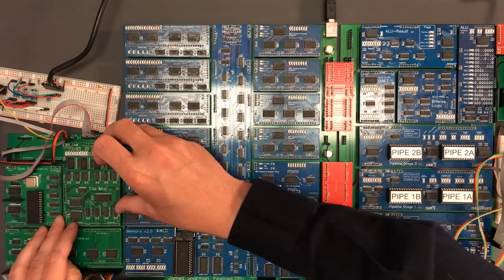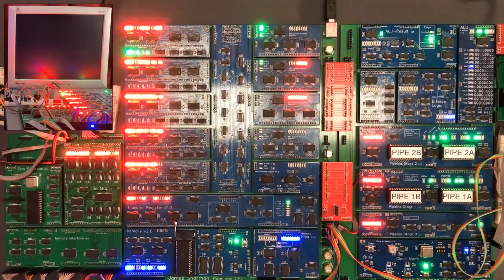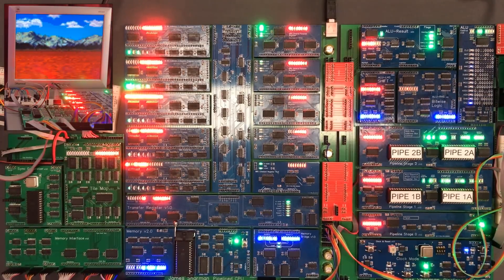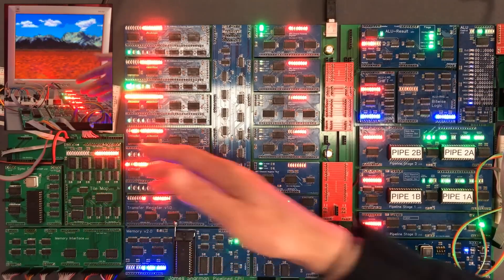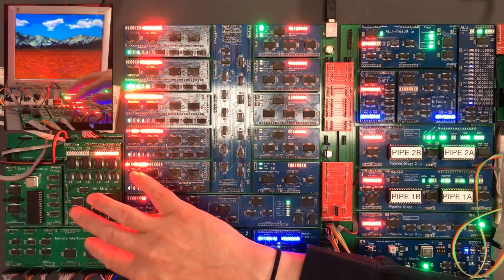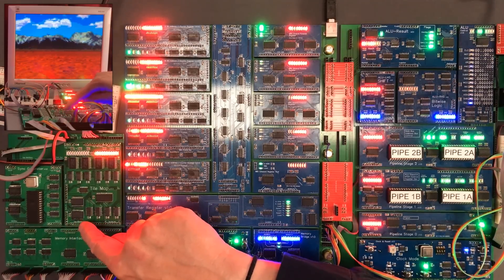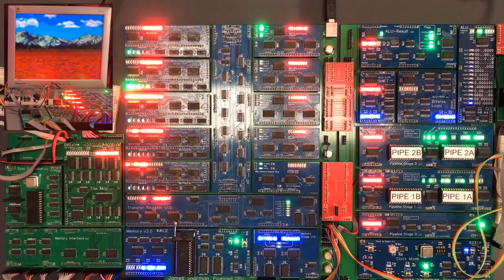Let's get this thing back in. The screen's gone black, which is correct behaviour. Perfect — that's amazing. Obviously it would have been awesome if we got this perfect working first time, but considering a lot of the touching up we normally have to do, particularly on the resistor arrays, this soldering method has actually still proven to be really good. Those three pads that didn't flow properly — the alignment of this chip isn't quite perfect and maybe the solder paste wasn't absolutely spot on. I'm going to look closely at the footage once I've got it off the camera to see how that was.